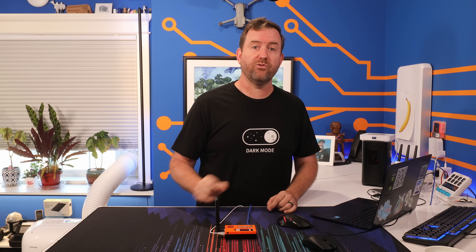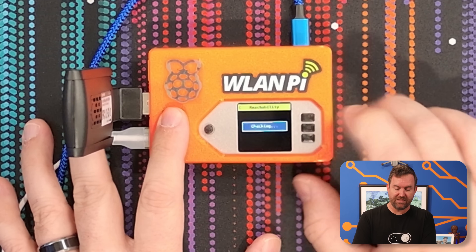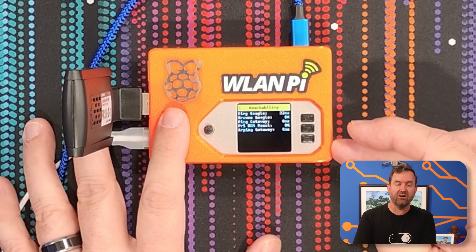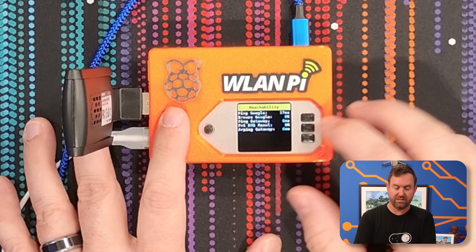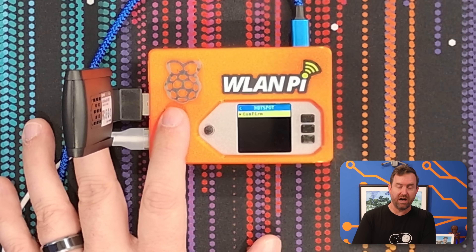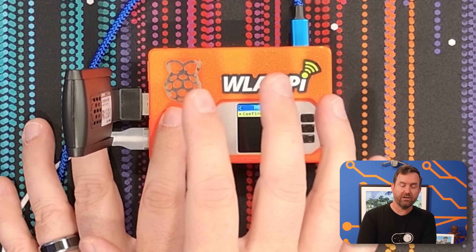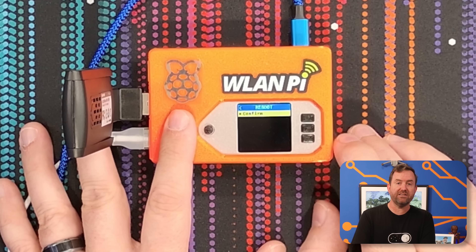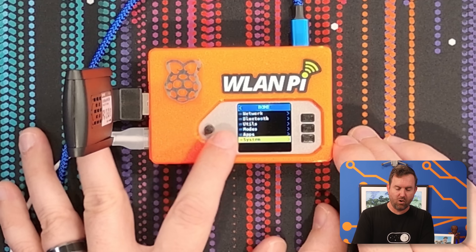There's even more that can be done through the display screen. The buttons down the side are pre-configured — here's our reachability, which shows latency out to the internet and round trip time to Google, so you can see those statistics at a glance. The second button turns on a hotspot, because this can act as a local hotspot and bridge through to the Ethernet port of the device and out onto whatever local network. The third button is to reboot the device.